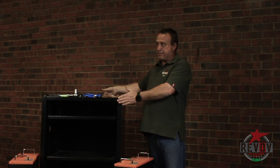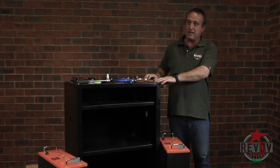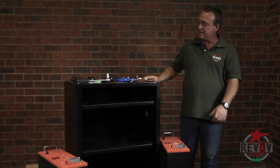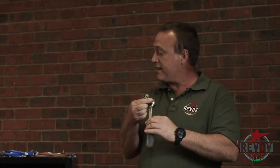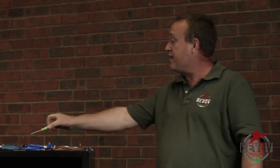The other thing you'll need is a cabinet — they come in all different shapes and sizes, and this is the cabinet that is sold with this set. Tools needed to install this entire setup are basically a 14mm spanner or ratchet spanner to tighten the terminals on the battery, and a small screwdriver to put your reference cable into the front of the BMS. That's all you need to install this entire setup.